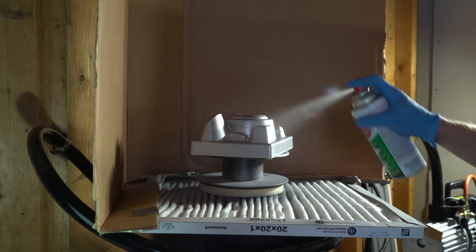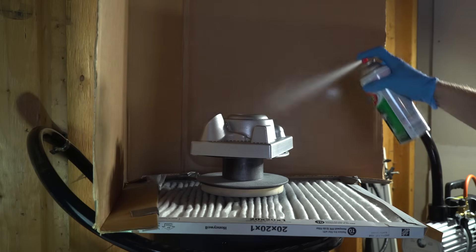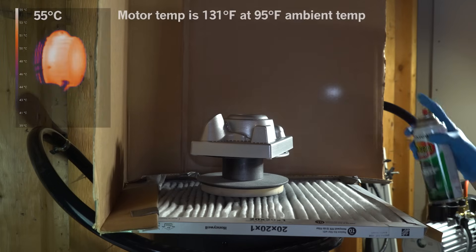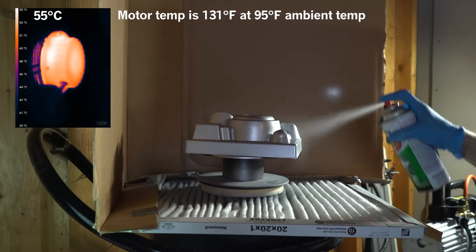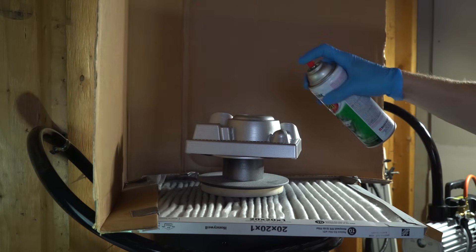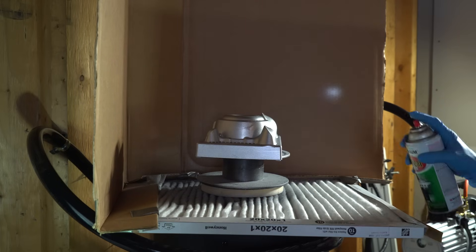Another use I've found is a quick and dirty spray booth. The results are good, but I would definitely recommend only using the fan with an enclosed motor and not running it when temperatures are over 90 degrees. This motor is probably not hot enough to ignite the solvents in the paint, but it's not worth finding out. Always remember to ventilate your space and wear a respirator when working with high VOC products.